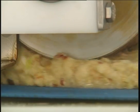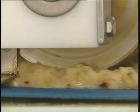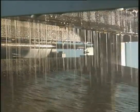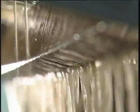Via a variable speed feeding roller, the mash is spread uniformly on the lower belt. The height of the mash cake can also be adjusted with the feeding roller. Underneath the feeding roller, the first juice is extracted through the belt due to the static pressure of the mash.